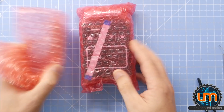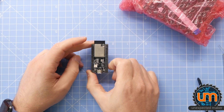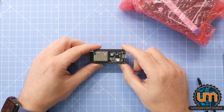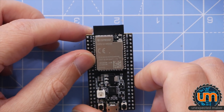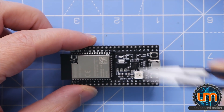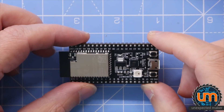In the meantime, I've got these two development boards. This is the first one — the final version of their development kit example prototype board. Look at how the antenna sticks off the end. They stuck a very large 5050 RGB LED on it. It is the ESP32-S2 Rover. And it also still has a CP2104 on it. They have deliberately kept the separate USB on their development boards, for those that want to use USB to talk to the S2 and use the on-the-go on the S2 for other peripherals — though obviously you can't use both at the same time.